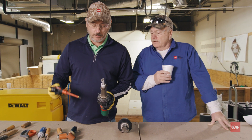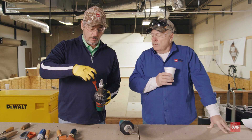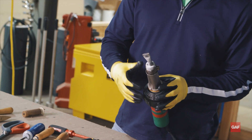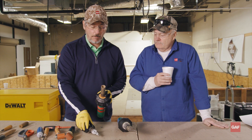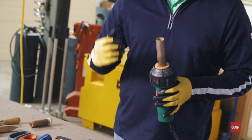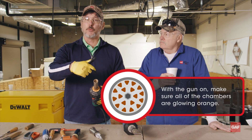All you're going to do — there's four screws on here. Take your screwdriver and remove the screws. Wally and I always keep an extra heating element in the truck in the glove compartment. You never know when one's going to pop on you. Take this nozzle and barrel off. Again, be careful — don't lose these screws. Slide this barrel off. Now, this is what's called the mica sleeve. Make sure this sleeve stays on when you remove that barrel. Slide it back on, make sure it's underneath this little washer. Then turn the gun on, turn the dial to high, and look down in there — all these chambers should be glowing orange.